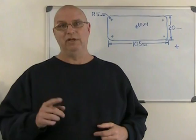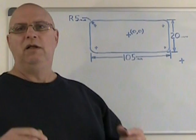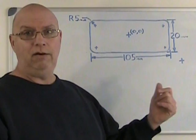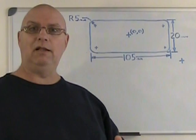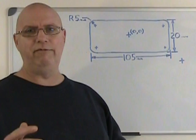So we're going to be using a 10 millimeter tool to get the proper corner radius. But 10 millimeter tools don't take a lot of material off quickly. They're actually pretty delicate tools. So we are going to rough out the pocket using a larger diameter tool. We're going to be calculating coordinates for a larger tool and for our smaller 10 millimeter tool. Our larger tool here is going to be a 3/4 inch diameter two flute end mill.